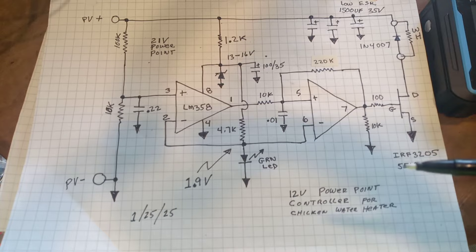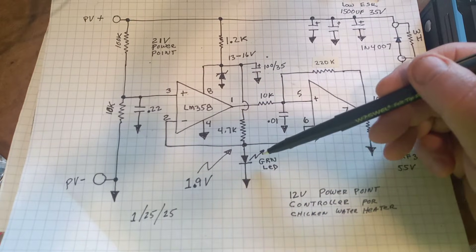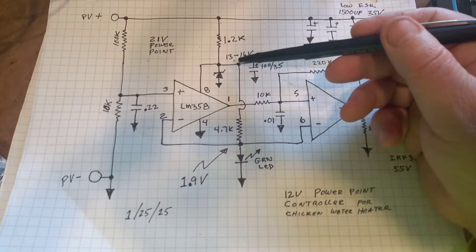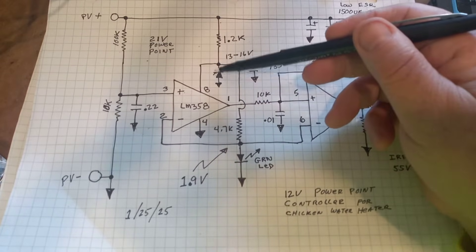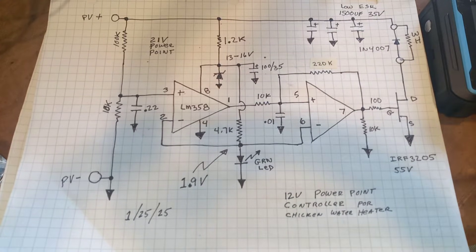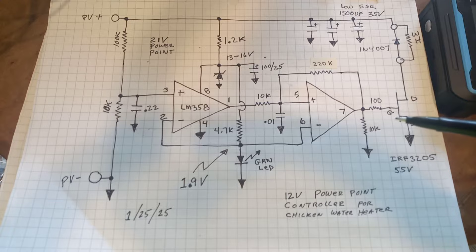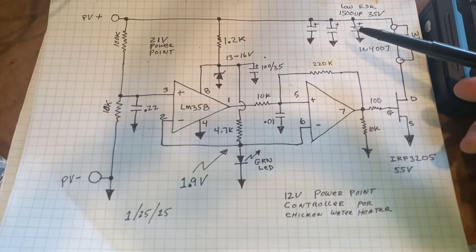Very simple — I come in with a 100K resistor and 10K, and that gives me about 2 volts at 21 volts. You can see the green LED is set up and it gives you about 1.8–1.9 volts. You could use a red LED, or a zener — you'd want to set that between 13 and 16 volts. Really you could just put a bunch of LEDs in series. If you're buying LEDs you'll get a package of probably 50 for a small price, so there's no need to buy the zener.